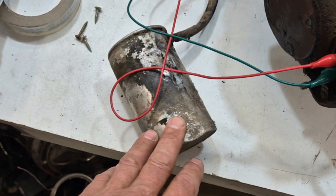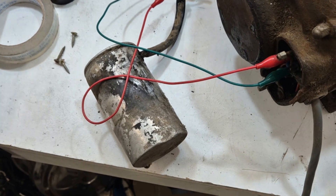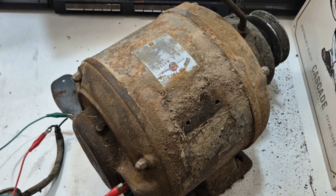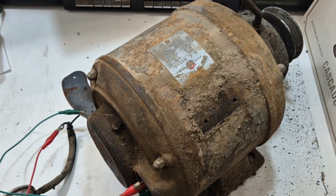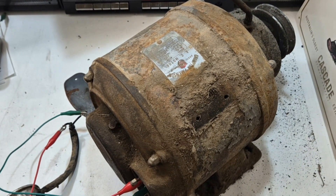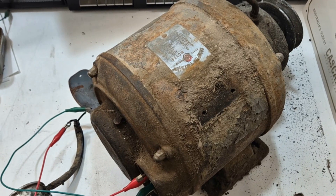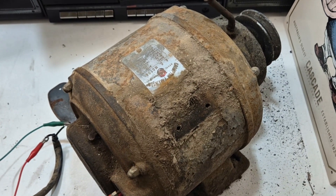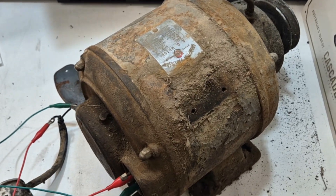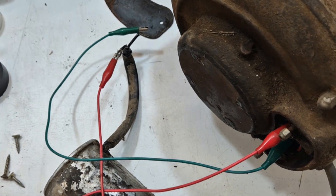The capacitor is this grotty looking thing here with a few dents in it. It turns out - talking to the guy who owns it, a neighbor dropped this into me, one of his friends - it intermittently won't start and just sits there and hums away and won't run at full speed. Of course when I tried it a couple of times it was fine. I actually disconnected the capacitor here to check it.